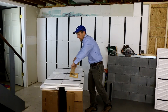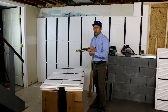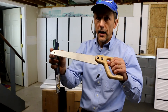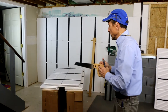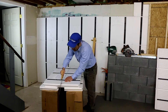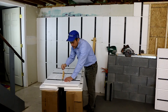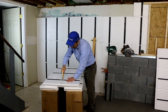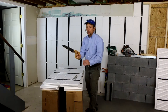There are several methods to cut InsoFast. One is with a regular handsaw. Now, this is a sharp-tooth PVC pipe cutter. If you look at the blade on here, it's real sharp and real fine, and that will give you a good cut when you're cutting foam. So you're going to follow that line and just make nice, even cuts, letting it come through. And when you get to the stud, that's where you need the saw — you don't need it for the foam. You can do the foam with a razor blade knife, and when you get to the stud, it's nice to have a good sharp handsaw.